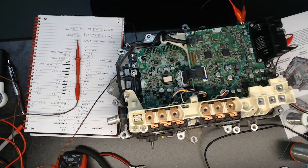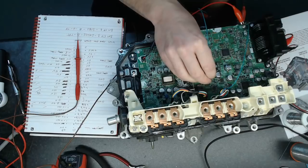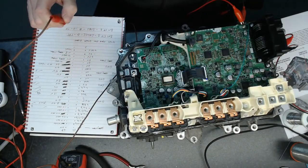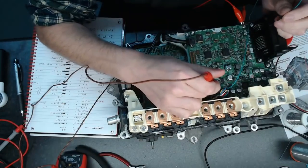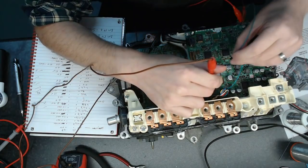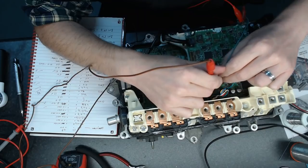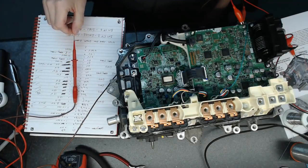Alright, let's turn this transistor on. This could get interesting. Oh yeah. Our current just increased a lot when we turn on that transistor, guys. So that would tell me we're waking up our IGBT driver board. Ooh, party time. Now, if I look on pin 50 and I ground the gate of this FET, oh yeah, there's 5 volts. Our current jumps up to 1240 milliamps from 1150. So we start taking another 100 milliamps. So that is rather interesting.